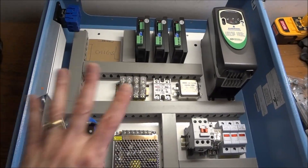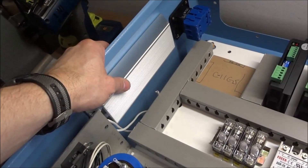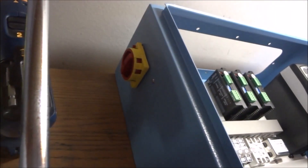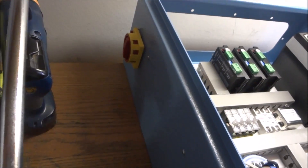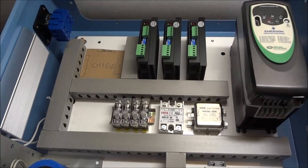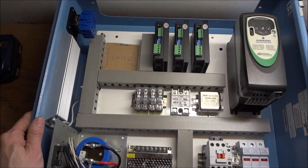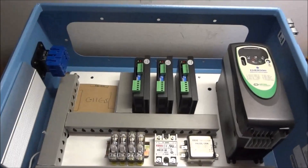I've got the panel sat down inside the enclosure. I've got my brake resistor mounted and my main disconnect mounted. You can see this will be the front side here and the main disconnect will be up top. Everything looks like it's got pretty good clearance and we should be okay — it's coming together pretty nicely. The next thing I want to do is figure out all my connections going out of the box.